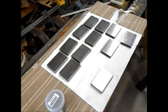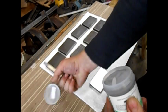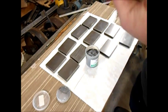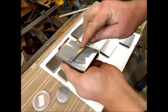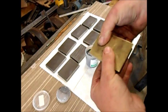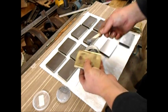Okay, here we are. I've got the plates, got my brass very nice and clean. Don't want any oil or anything on these because it will hinder the solder. The stuff's a lot thicker than I expected - I've never used it before. It's kind of like Play-Doh. I'm just going to try and smear a bit on. Presumably if I put the brass on and give it a bit of a squidge around - it's spread it quite nicely. So that's probably the best thing to do. Keep going, next one, another dollop.